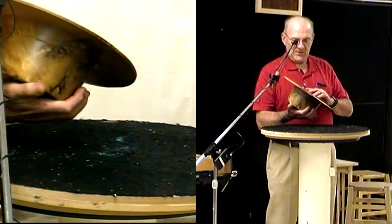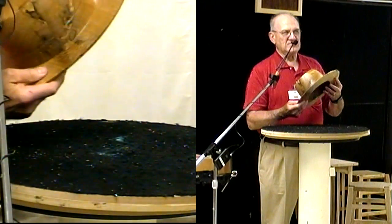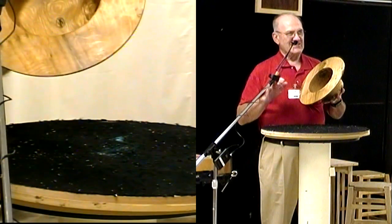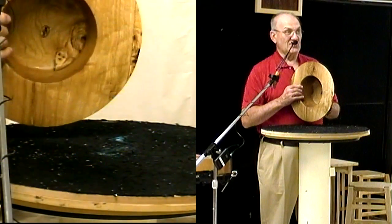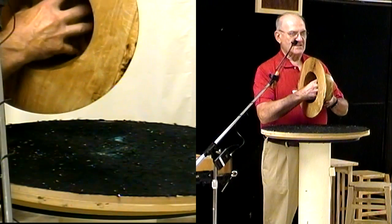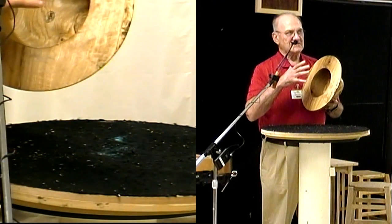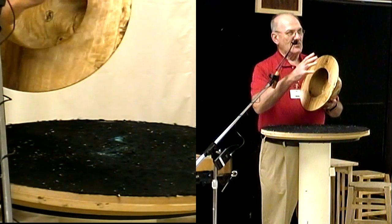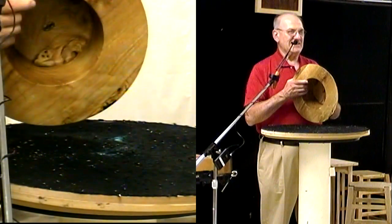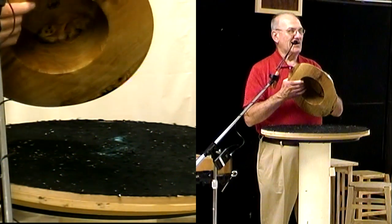And so then the trick to get the top turned loose, I've got a vacuum chuck on my lathe. And for those that don't have one, I'd say put pennies in a jar, because they are an absolutely wonderful addition to your lathe. So anyway, the 5-inch bowl sits on a headstock, and it's got a double thick, probably 1/4 inch thick neoprene, what do they call them, closed cell rubber on the face of it. And boy, they just pop up. And if you look at the gauge and you've got 18 or 20 inches of vacuum, you just turn like it was locked into your iron chuck.